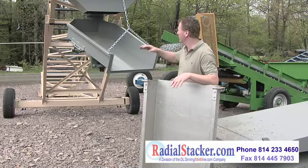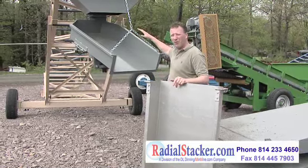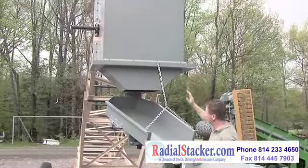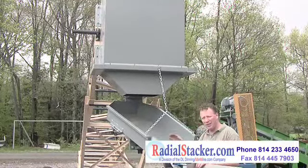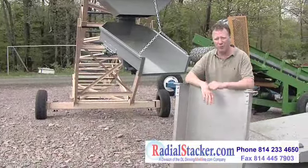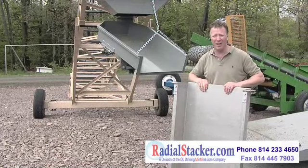These pieces can be covered so that there's no contamination of material. It also will prevent dust. If you have the conveyor covered right up to the discharge hood, right down to the chute, and the chute is covered, it will contain all your material — you'll have no dust and very little breakage.